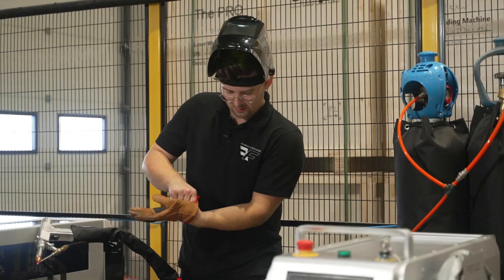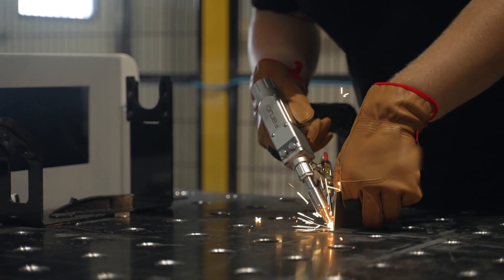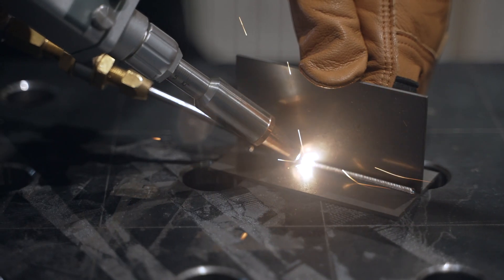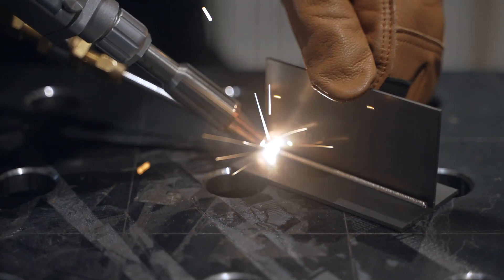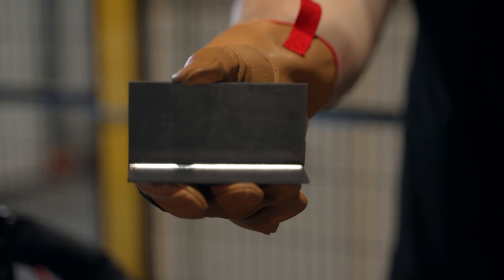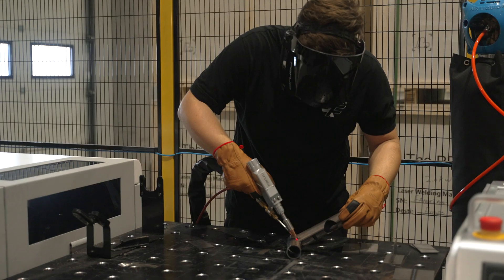We will start with black steel. Welding with the fiber laser ensures deep, full-weld penetration while maintaining the material's structural integrity, giving us a weld that looks good and is strong. This type of weld is very small and has a very limited heat-affected zone, which results in its strength while requiring very limited post-processing.